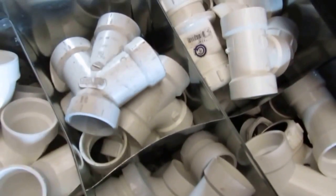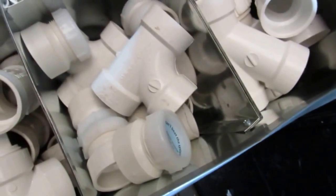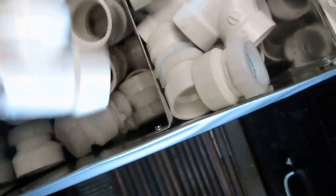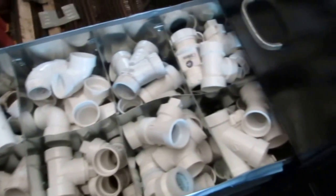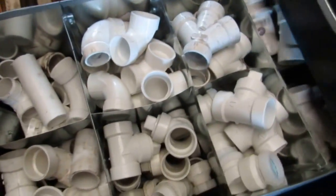When I need plumbing stuff I know to go to that bin. This bin down here is all inch and a half PVC: 90s, street 90s, TYs, Ys, inch and a half Sancos, inch and a quarter Sancos, 45s. This stuff is all for working underneath the kitchen sink to repair or replace the drain. I cut out the old stuff and put in all heavy-duty PVC. I'm always in here, so all my inch and a half stuff is there and my two-inch is over there, though I hardly use two inch.